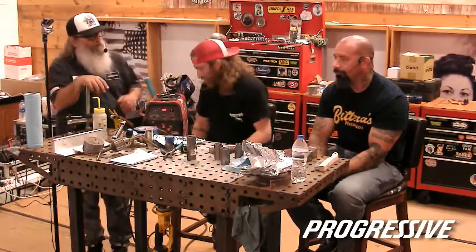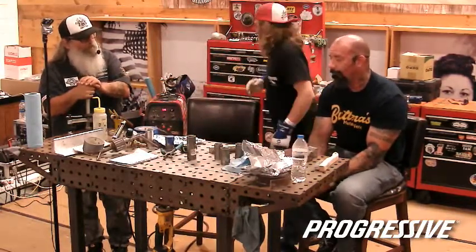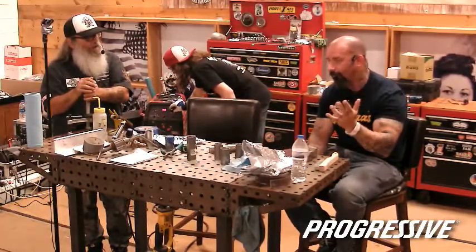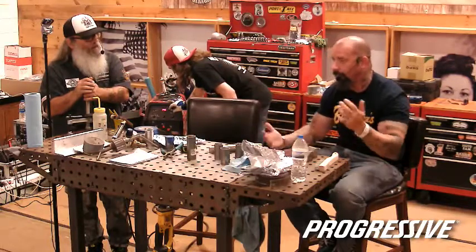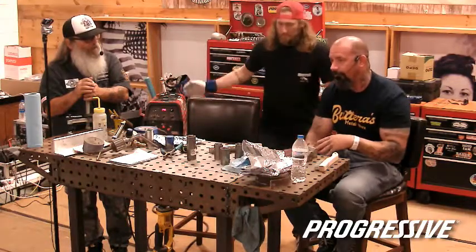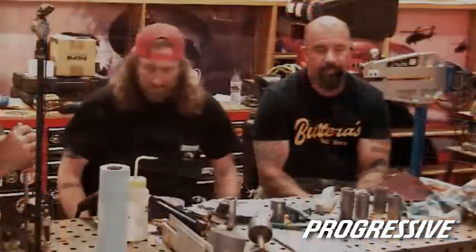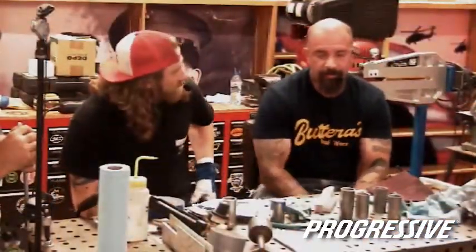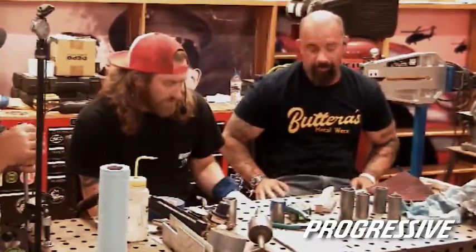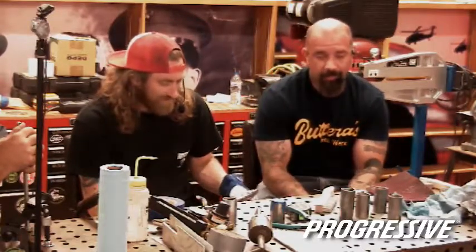Yeah. But if you take all the procedures, even going back to the most basic things, on the sanitary side of it, when I do my frames, after I bend them, cope them, everything's ready. They're fully polished, wiped down with acetone, and then welded. So it's quite a process, and through that I cover all my bases. So to answer that, I don't purge weld them, and I don't think it's necessary, but hats off to who does, because it's a lot of work. Oh, it's a lot of extra.